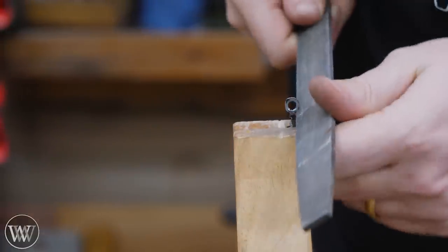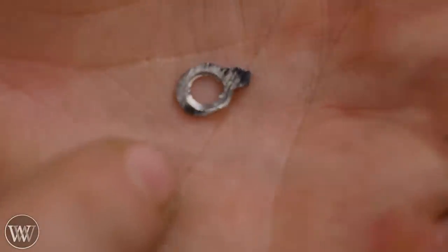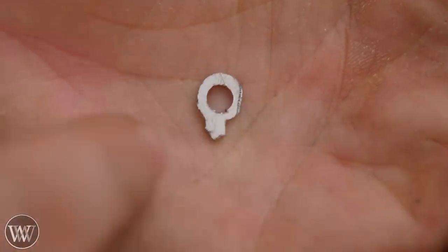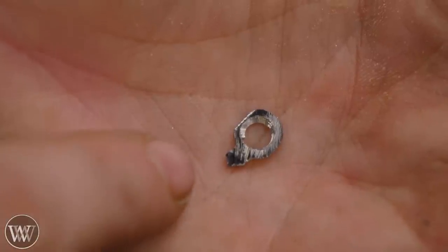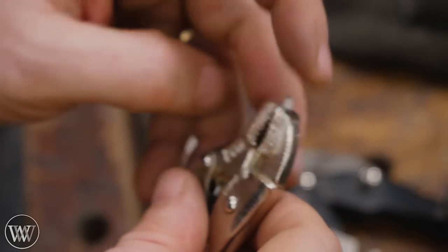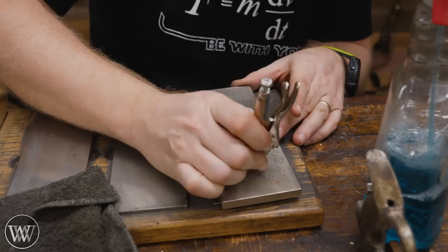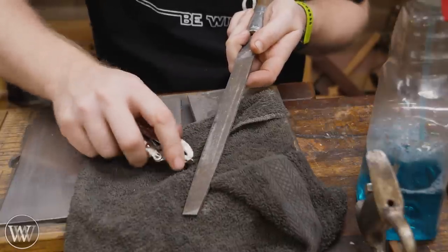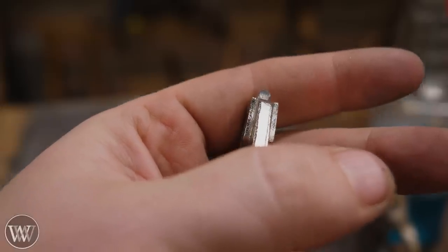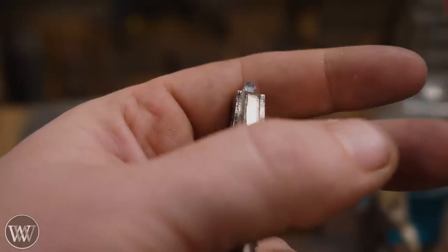So now I want to create that rounded bit on the bottom that actually becomes a knife, and I want that bit to be sticking into that black sharpie line. Back into the vise once more — use the corner of the file to create that notch, then come in from the other side and make that notch connect. When I get really, really close, like the nib on a saw, you can just break it off. And there's the rough shape. We need to do a little more work to sharpen and shape it, but for that we're going to use a pair of vise grips. I also want to remember: the side that has the countersink is the side I want out; the side that doesn't have the countersink, we want to put that back. So I want the sharpening bevel on the side that does not have the countersink. For most of the shaping I'm going to use the extra coarse stone and round it into a slight rounded shape — or if I still have a decent amount to remove, I can use the file. I'm just trying to get that rounded shape on the tip right now. You can see I have a relatively nice rounded shape on there.